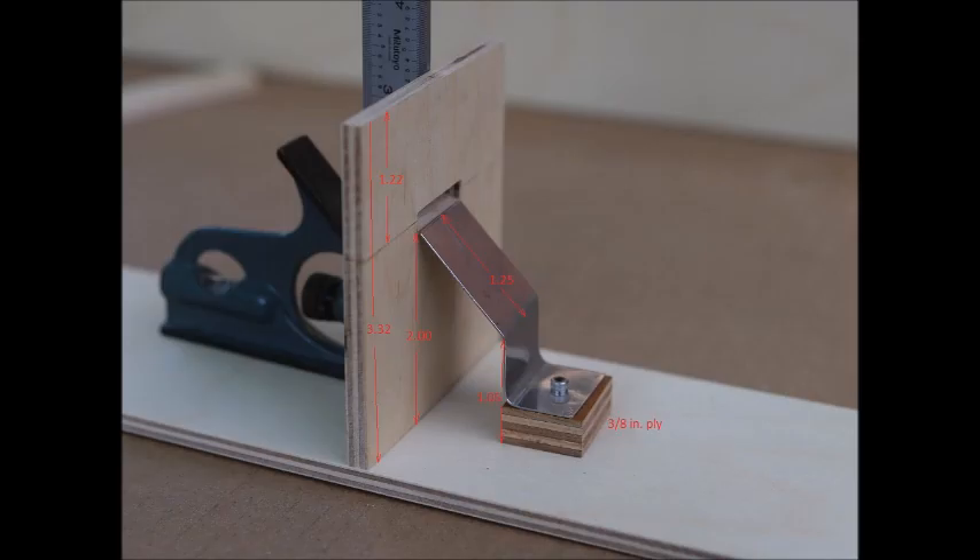The pick-off mirror is mounted on a little square of maple plywood, holding a bracket of 0.060-inch stainless steel bent as shown. You need to make sure the height of the mirror is slightly lower than the opening to the coarse slit. You can rotate the bracket and also bend it for alignment.